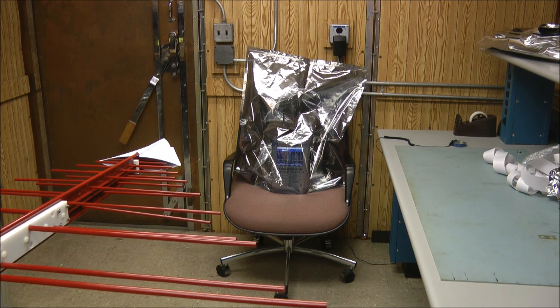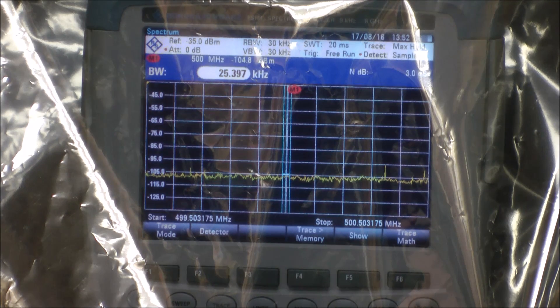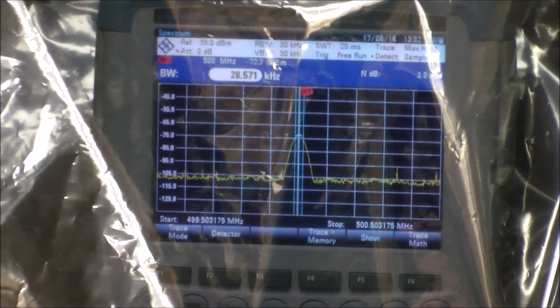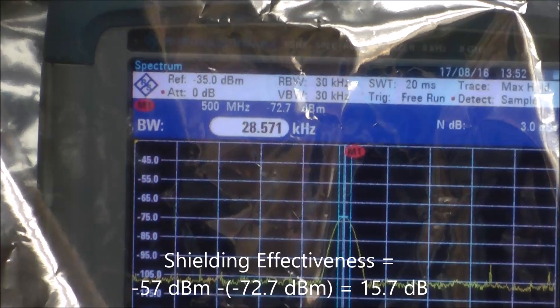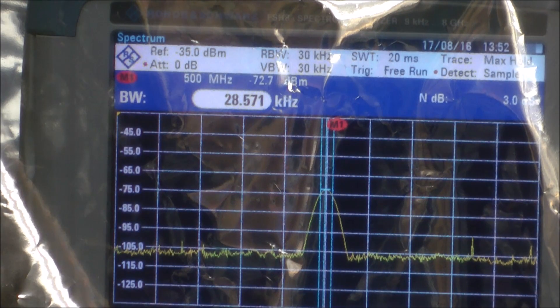My next experiment is to test one of these anti-static bags. I have several — probably a dozen different types. This one is not a high-performing bag, but it is fairly translucent so you can actually see the signal inside the bag on the spectrum analyzer. With the transmitter off there's no signal, and when I turn it on you can see the signal rise. The energy getting inside the bag measures about minus 72 dBm, which is only about 15 dB of shielding effectiveness compared to the open air test at minus 57 dBm. That's not very good — 15 dB is certainly not enough to protect against an EMP — so I would classify this bag as a poor Faraday cage.